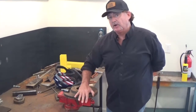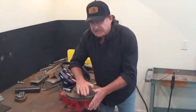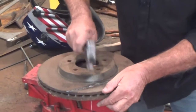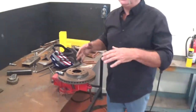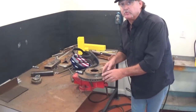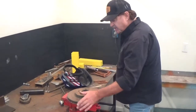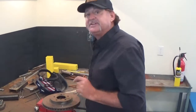If I can touch this, I know I'm below 200 degrees — that's where we want to stay. What are we doing? We're stress-relieving. By peening, we're driving the weld back down into our canal or trench that we created, without grinding. So after it's easy to touch and I know I'm below 200 degrees, can I keep welding? Yes. Do I want to weld in the same spot? No. I want to skip weld.